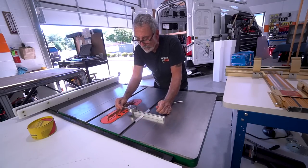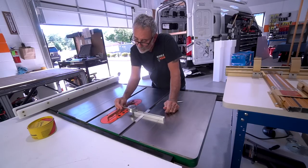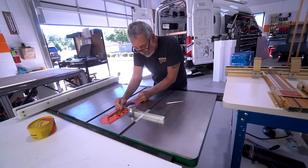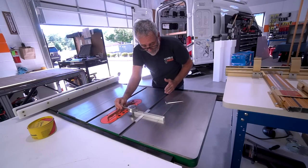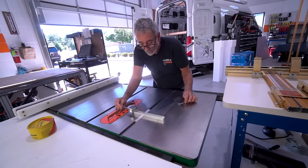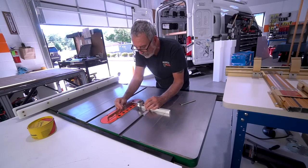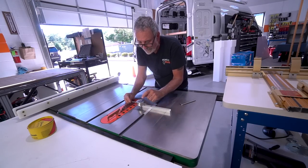As it turns out, we're still within range. This should be around one one-thousandth of an inch off. Zero to zero is ideal — that means you're dead on parallel to this crosscut. Right now we're actually a little bit off. I can play with this to get it back down to a thousandth. Let me zero that out.